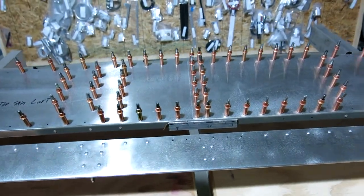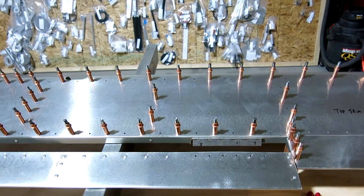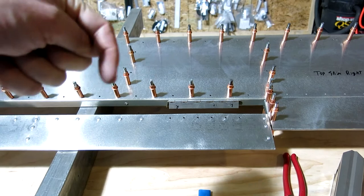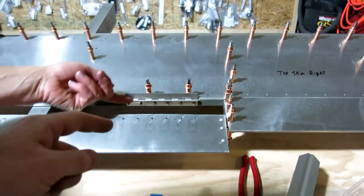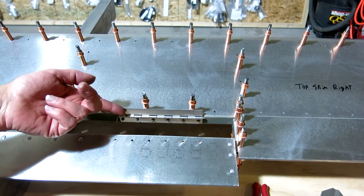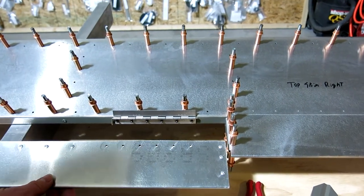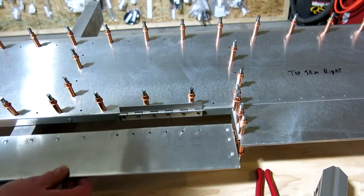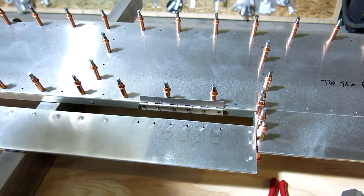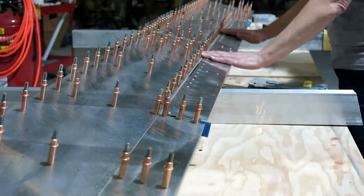One thing I didn't show, we already finished fixing it after we did it. When you cleco the hinges on, be sure you cleco them from the inside. Not from this side. We clecoed all these hinges all on here. Got everything all nice and trued up on the bench here, and went to put this on and went, wait a second, there's cleco sticking out of there. So we just went and flipped them around, put them in from the back side. That's a couple minute mistake.